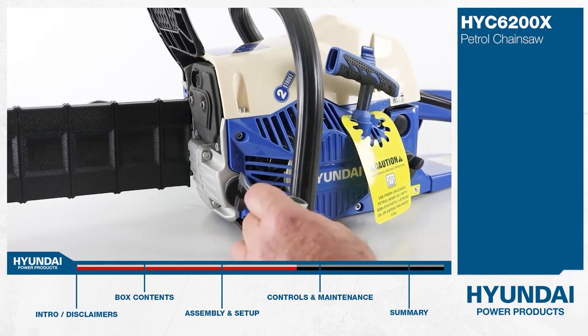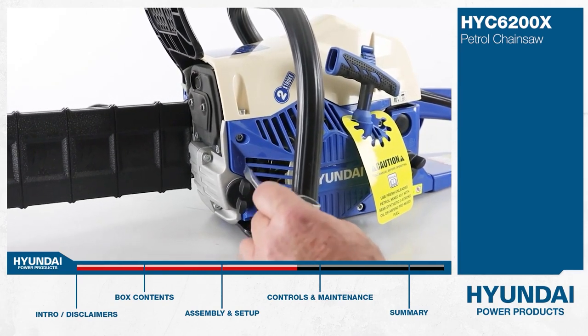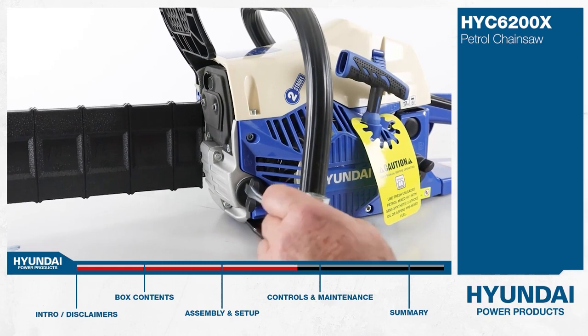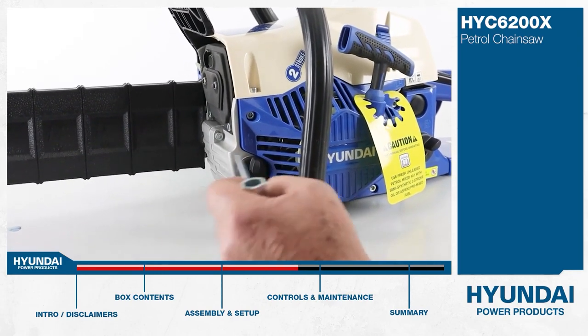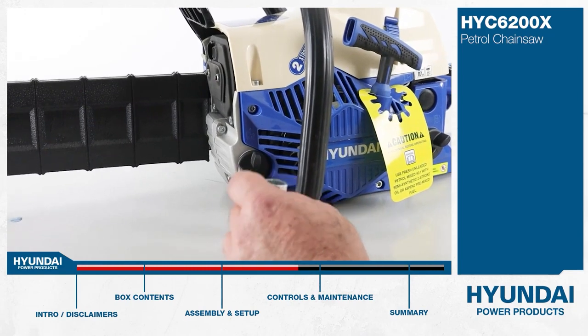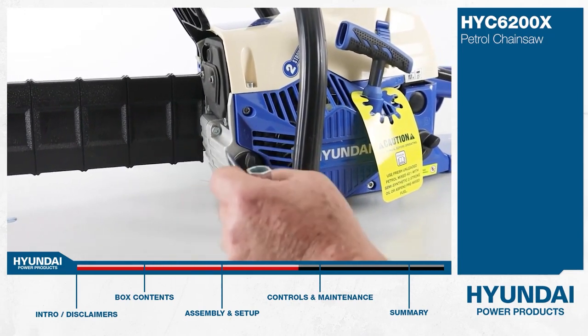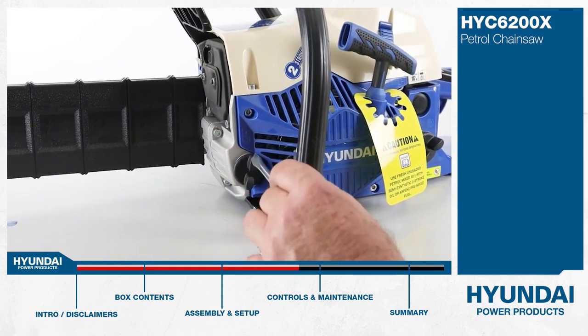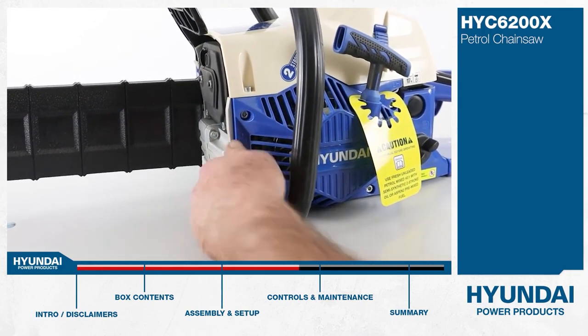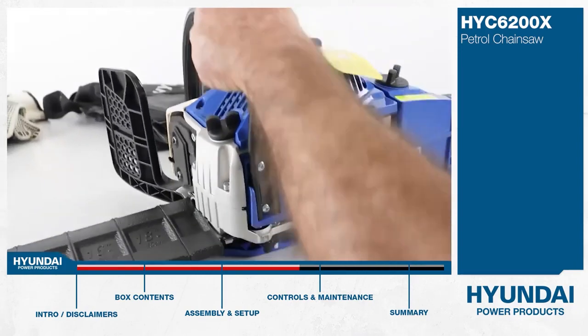It's readily available in most tire shops and what have you, and garden centres, that sort of thing. Chain lubricating oil. Don't be tempted to put normal engine oil in here. It's way too thin and it would run out and make an awfully bad mess all over the place. Spray oil all over the chain, all over yourself and what have you. Use chain lubricating oil. So, to fill it, I'm just going to tip it on its side.